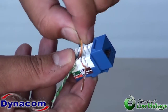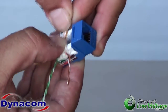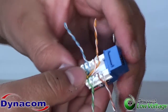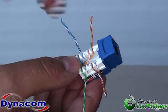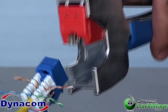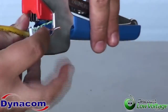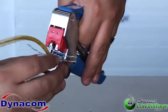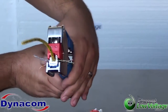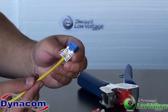As I said, with the peaks it makes it easier to separate the pairs when you install it. So you might want to just come down here, untangle it a little bit, and go ahead and push it in — just like that, boom, you're done. It'll help separate the conductors. Then with the new tool, you're going to go ahead and slide it into the front of the jack, and what this tool does is it terminates and cuts all the pairs at the same time.